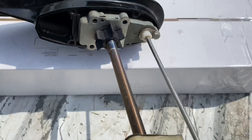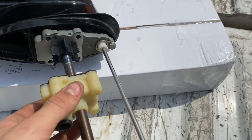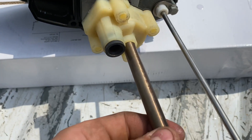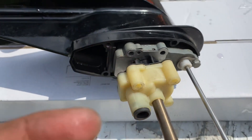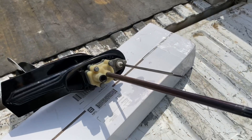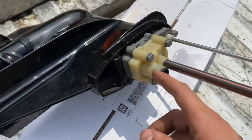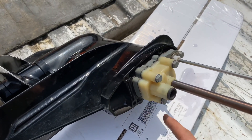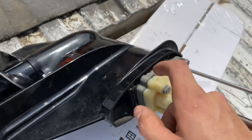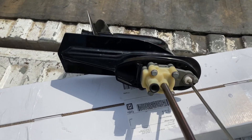There is a keyway in there, so you'll have to watch the keyway whenever you put your new one on. To reinstall it, you just slide it back on there, then push it down on the housing while turning the shaft clockwise — I believe it's clockwise for this one. Just push it down until it's flush like it was before. I got the impeller housing and the impeller put back on — I just twisted it and it slid right into the housing. Put your four 10mm bolts back in and snug them down by hand. I wouldn't use an impact on it because this is just plastic threading into aluminum.